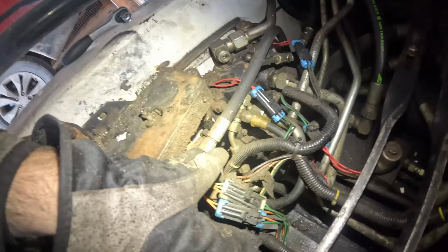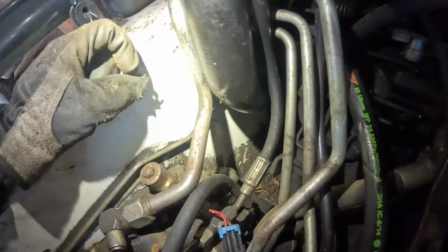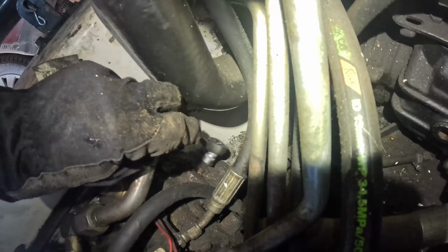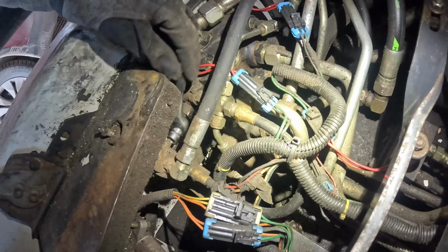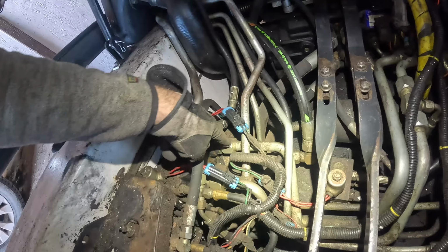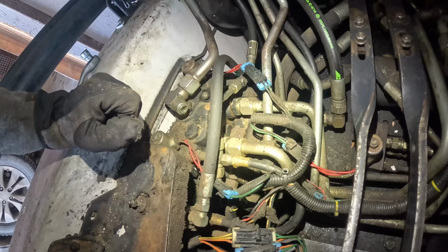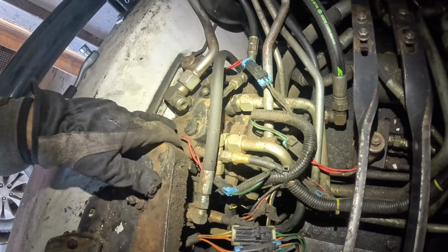Down there somewhere is the auxiliary pull spring. It's on both sides, so that thing there, and on this side as well. The auxiliary lines themselves, A and B. This block here is supposed to be the auxiliary relief valve, but that's apparently optional. So on my machine, that thing is just kind of blocked off. I don't think I need to open that.